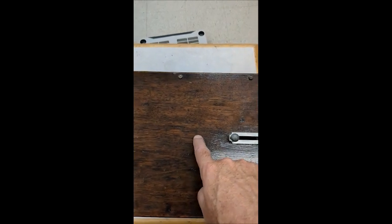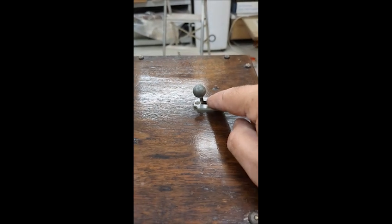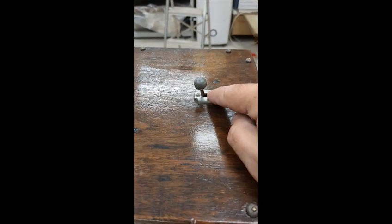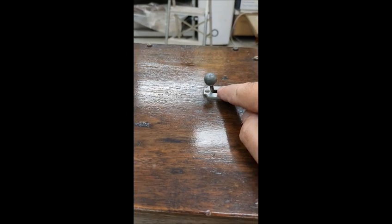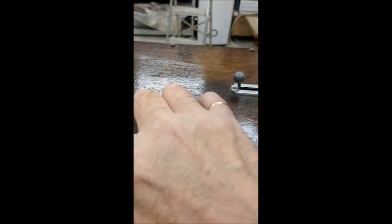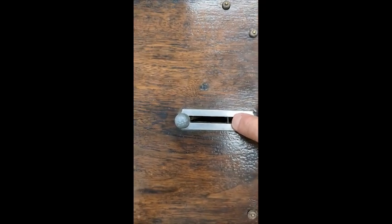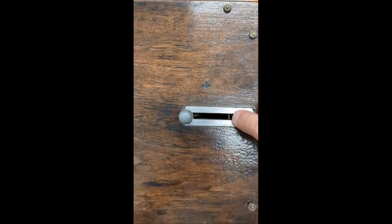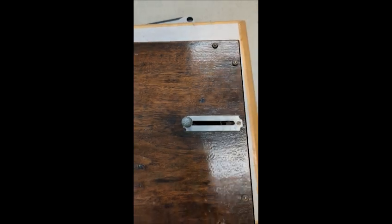That hammer is then connected by a wire to this lever. Pulling back on the lever, you pull back on the hammer, and as you let it go, the hammer then strikes the bell. There is a small pin here which is basically telling you that's the maximum torque you can put on the lever. If you went any further, you would probably crack the bell. It's a very simple design — the box and the inside.